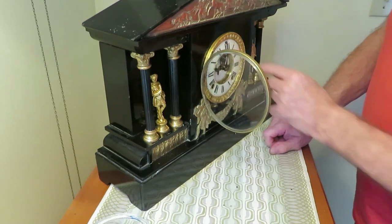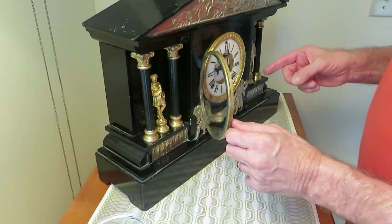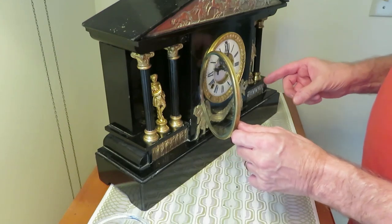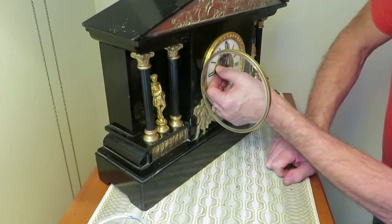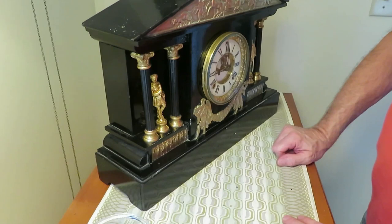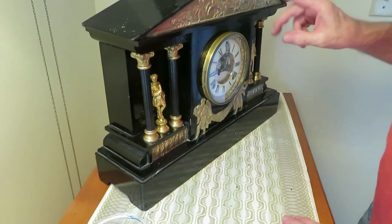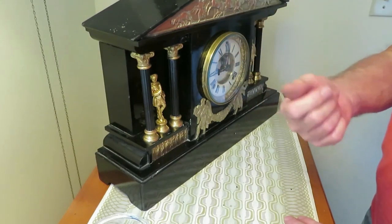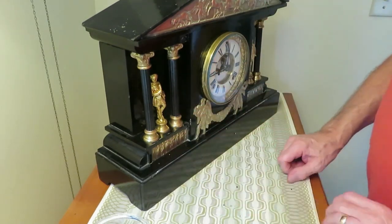Let's see how the timing is when it reaches the hour - 1, 2, 3, 4, 5, 6, 7, 8, 9. I think that was 9, so I'm going to set that at 9 o'clock now. Then I'm going to get the pendulum working and get the striker striking against the spring. I'll let it run and regulate it - there's an adjustment at the top or you can alter the pendulum length. Then we'll see about getting it delivered to my son.